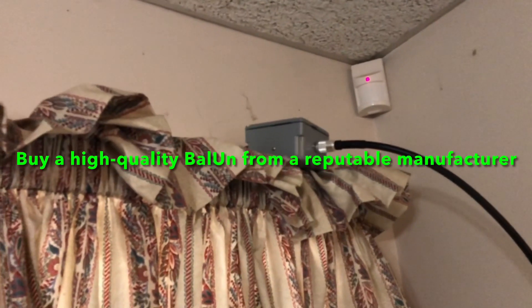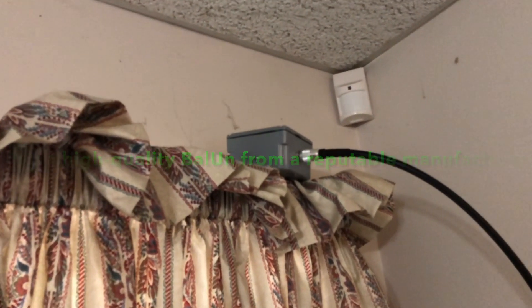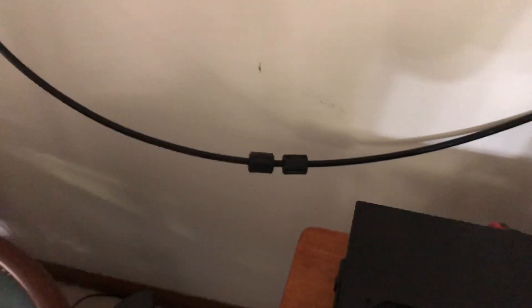When I'm running 800 watts with a balun rated for 3,000 watts, there should be no heat buildup at all. It's a terrible thing to have RF in your audio, and it's a real gut punch when you get on the air and somebody tells you you sound terrible. That simple solution took care of it.